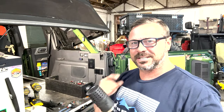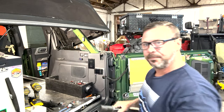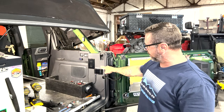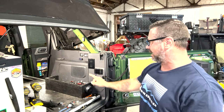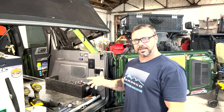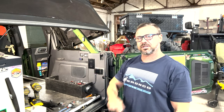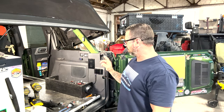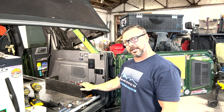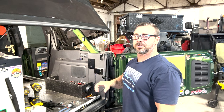All right, people. This is the air filter. I'll bring you guys in here and let you see it. So what I did is I went ahead and knocked out the electrical, got that done and everything tied in. As you can see, where I chose to put my thermostat, it's right here. And the reason why I did that is because if the air is going that way, and this is the intake temperature, it's kind of like your house. You want your thermostat by your return air. That way it's going to circulate the air until the temperature going back into the heater regulates back to the temperature you set on your diesel heater or your thermostat at your house.